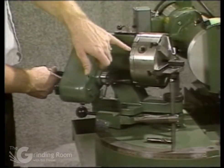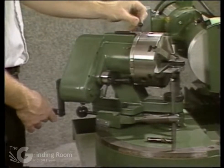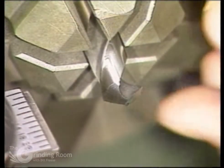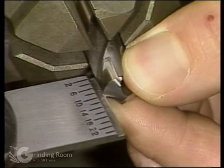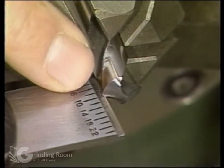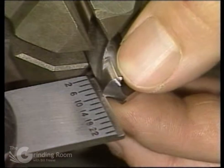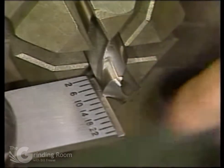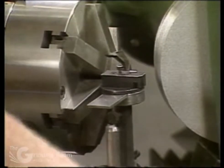To start setting up, there are several notches here on the work head. You set it in the right-hand slot for a right-hand drill. Chuck key in — put the tool in the chuck and then lightly clamp down on it. Slide in the setting blade from the side here. Rotate the lip of the blade onto this step. You set the drill out by a sixteenth of an inch of drill diameter. So in this case I have a half-inch drill, so I'd set it at the eight position. That should be held right down on there. Then tighten the chuck, pull the blade back, and the drill is set.